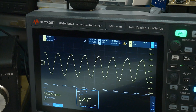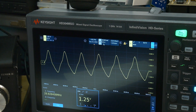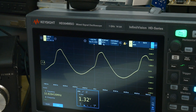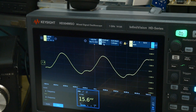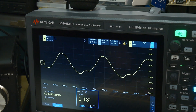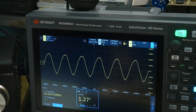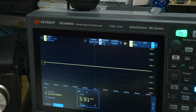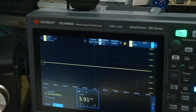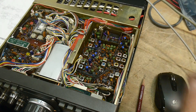It looks a lot better. One frequency - 10 meters, 21, 14, 7, 3. And then looking at the output of the VCO after it goes through the buffer and filter, it looks even nicer - 21, 14, 7, and 3. Everything looks great when it runs. Now I'm a little bit worried about shotgunning anything, so I'm going to take my time and not jump in and fix something if it ain't broke.